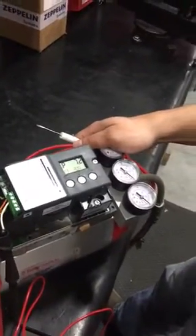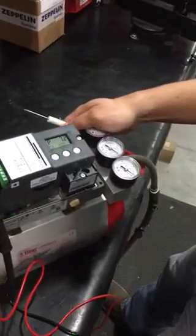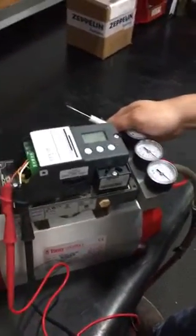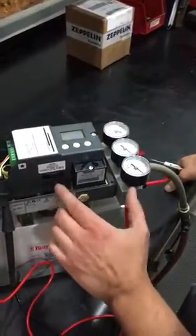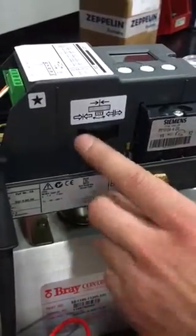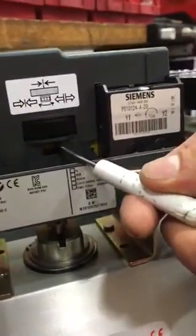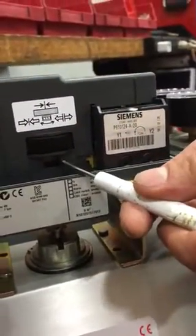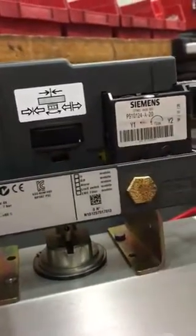What if it's stuck and it's not calibrating properly? How do you adjust that? When it gets stuck, normally it will get stuck in the first run or second run. You fix the potentiometer by turning this wheel right here. And if this wheel is hard to move, we adjust the yellow wheel in here, which is a lock for the potentiometer. By moving it to the right or to the left, you're going to loosen or lock the potentiometer.